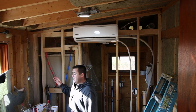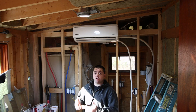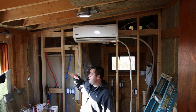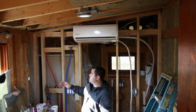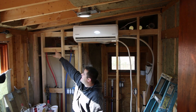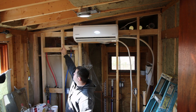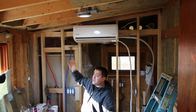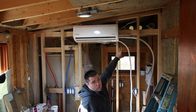Right here is going to be my stove. When you're boiling water it's creating moisture — I want to get that out, plus the smells from cooking. I'm going to try to find a range vent that needs to be the width of this stove, which is only about two feet. I'll do a range vent right here, have that pipe go up, cut out the top plate, the stud, one of the joists, and the plate in the back, and that'll go out that way. Then I'll have some flexible piping that runs in that attic all the way down into vent number two.